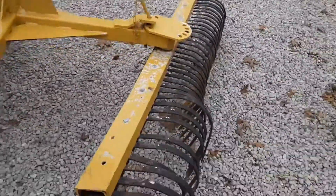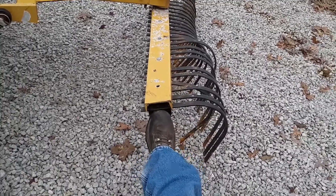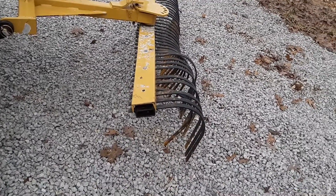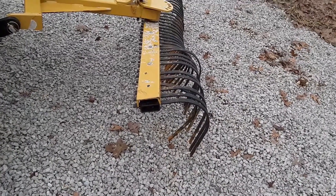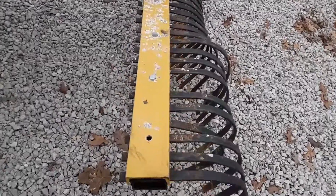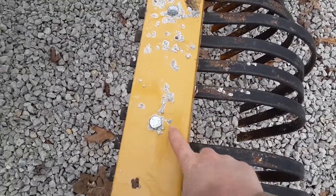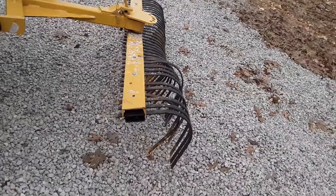What I'm gonna do is use some heavier duty c-channel I bought — it's a bit thicker so that should be better. I'm actually debating whether to weld a quarter-inch two-by-four on top, which would definitely stiffen it up. I could drill some clearance holes to drop the bolts all the way through and still have them bolt through that section, so I don't have to use six-inch bolts, which would be pretty weak.